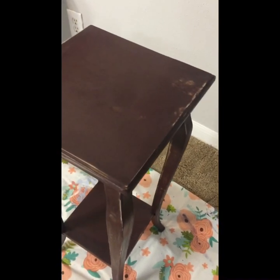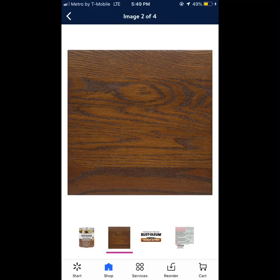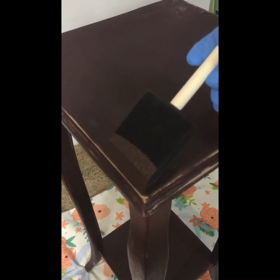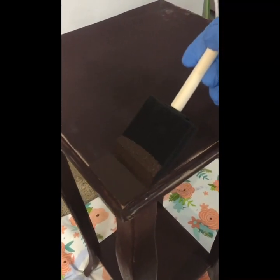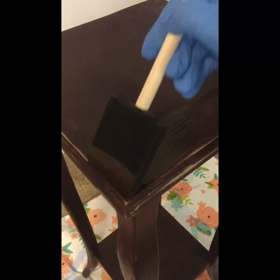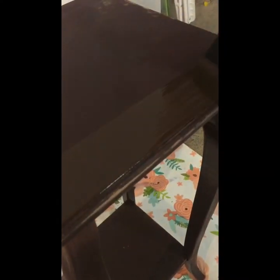This is what it looks like after the sanding was complete. I applied a little pressure where I thought it was a little bumpy. For the top I wanted a two-tone look, so I went with Rust-Oleum wood stain in American Walnut. I took it in a foam plate and used a foam brush to apply it just to the top.